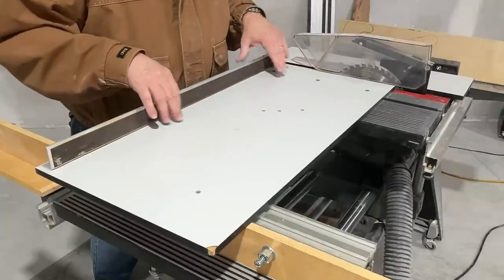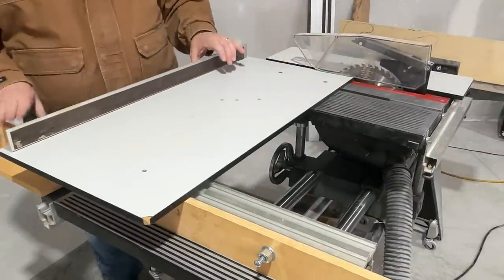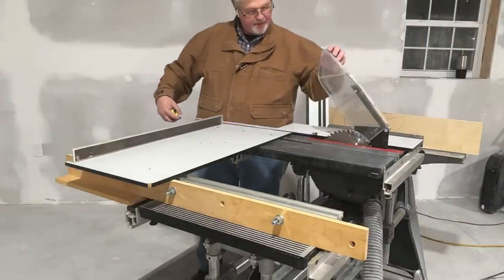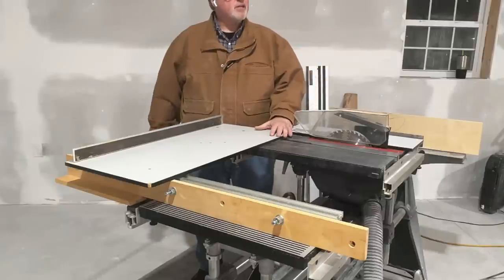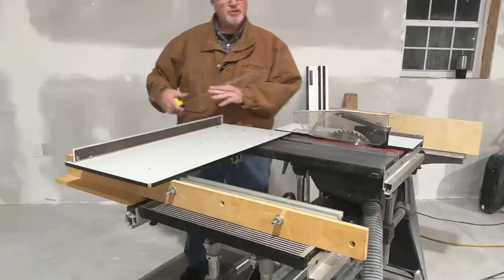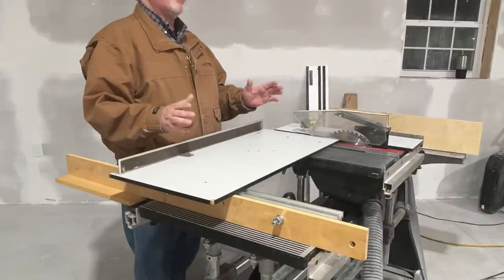Whether I have a 510, 520, or model 500, I like this setup just to give you that support. On my 510 with no hands, I'm at 20 inches on my setup for this cut, with about 8 inches of the bar in the slot. I'm good to go.